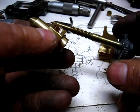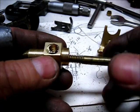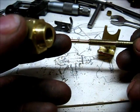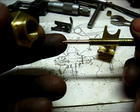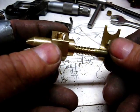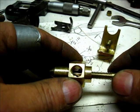You could change this jet out, but that's the only adjustment on that. I had one of these broken needle valves - that's off of a McCormick M, one and a half horsepower - just kind of fooling with it to get dimensions. I happened to find one that I had made a new one time and kept this on the side. It had been kind of dubbed off on the end, so I went ahead and cut the taper back on there and added some more threads to it so that it will go down in there and seat. When it goes in there, it will seat against the taper of this drill bit.